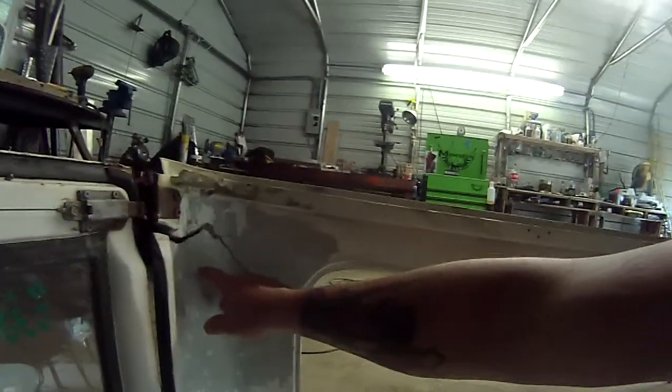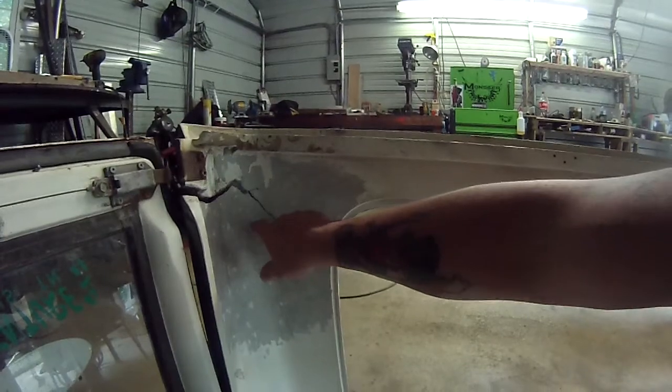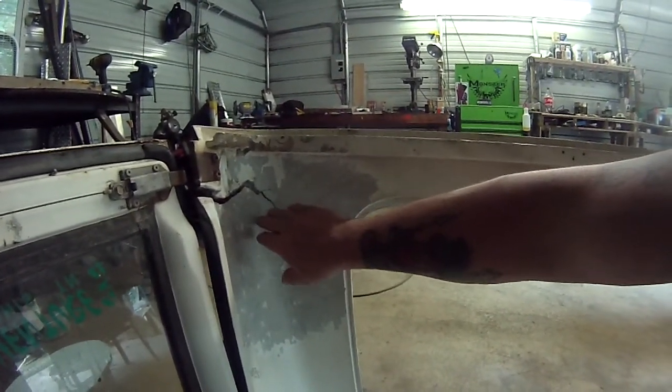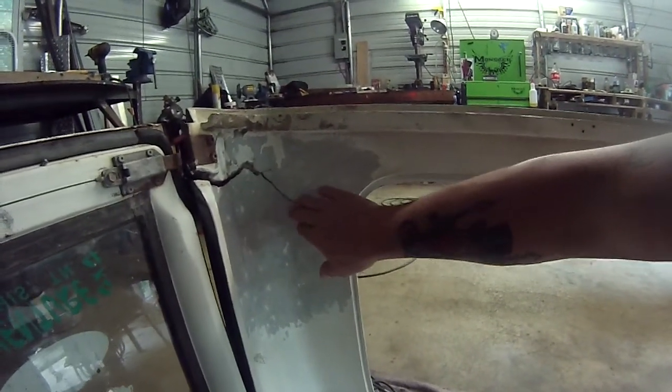Like I said, I don't know nothing about fiberglass, but one of the guys said if you drill little divots in the fiberglass, not go all the way through, but just little holes, and then when you put your goo on there and your mesh, and then goo it again, it kind of pushes down in them holes. And of course, obviously you do layers. That kind of acts as, if you know anything about concrete, like rebar and concrete, it kind of makes it stronger, a better hold.